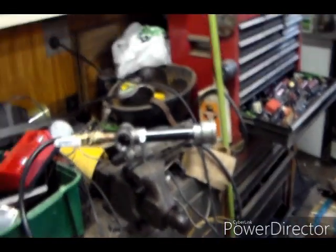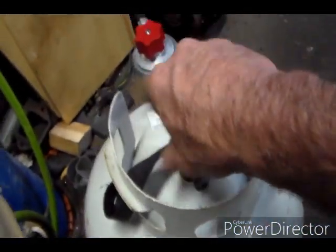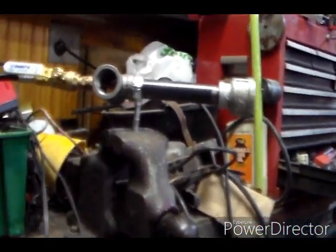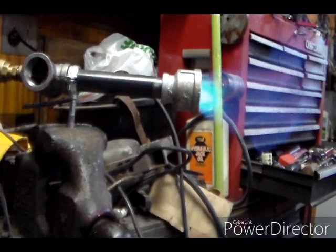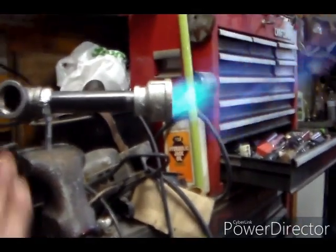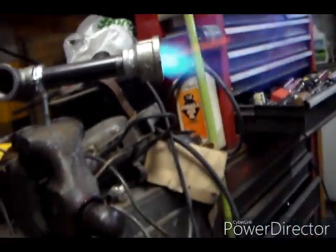All right, Frosty T burner test number 4, I reckon, I guess. Short nipple, big bell. Turn the gas on. This will be interesting. Yeah, I'm cranking in the adjustable regulator. Oh, hear that? A lot of woofy. But as soon as I cover half the air intake, I get a much better flame.